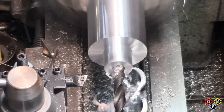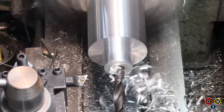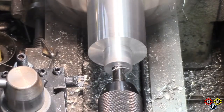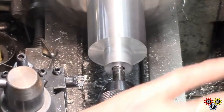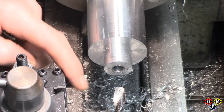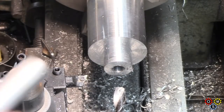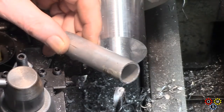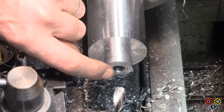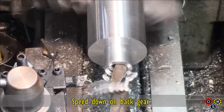Now, starting off some drilling, we're going to have to bore out the neck here for the tube to go in, but in fact we're going to go all the way down and bore right through, which will give us a start for boring the main body. And having got started with that size, we're going to go up to, there's the tube that we're going to use again. We're going to increase the drill size, get up to, I think, about 3/4 there.